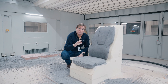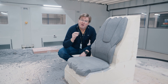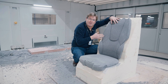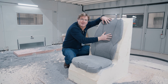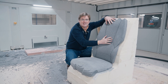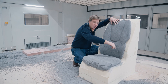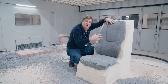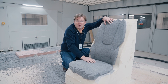When we compared the geometry of the original HX50 crew seat design to ergonomic best practice, we found predominantly that there was just too much curvature across the backrest. This breast piece that carries the perforated leather had been sunken into the back of the seat too much, so your back tended to bridge either side of it and not be supported in the centre. We've now increased the lumbar support slightly at the bottom, reduced the curvature across the seat to a 1000 millimetre radius, and then flattened it further up the back to give the best ergonomic profile possible.